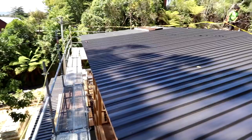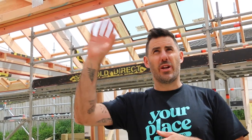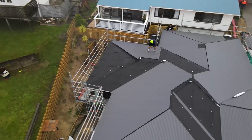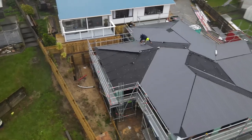Most of the sheets will come pre-cut. The roofing boss will come and measure up, work out the sheet lengths and the ridges, put an order in, and it all gets dropped off. Roofers will paper and then start peeling out those packs. When they come to the valleys, they lay the sheets out, work out cuts, cut them on the ground, make them nice and neat, then take them up and start installing those as well.